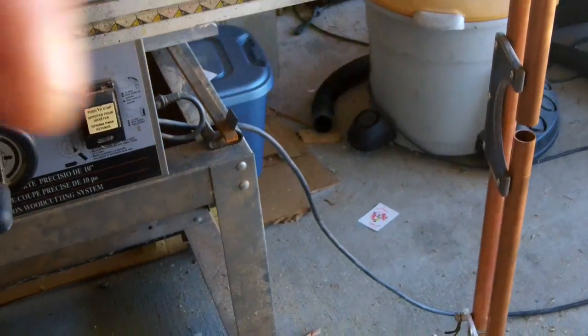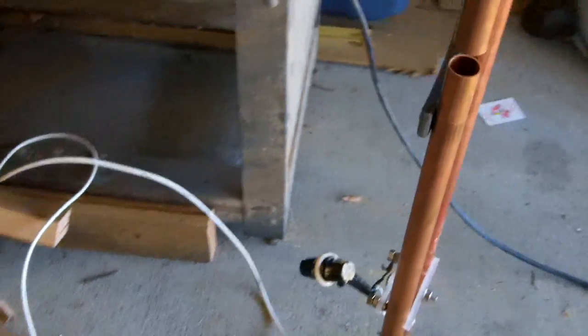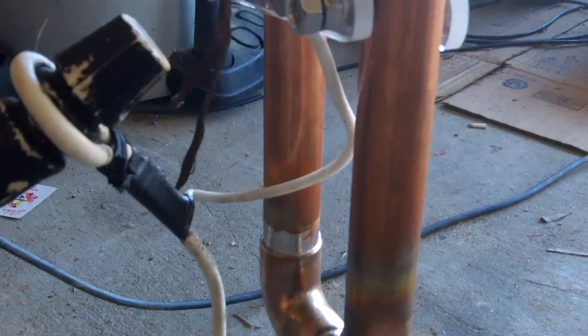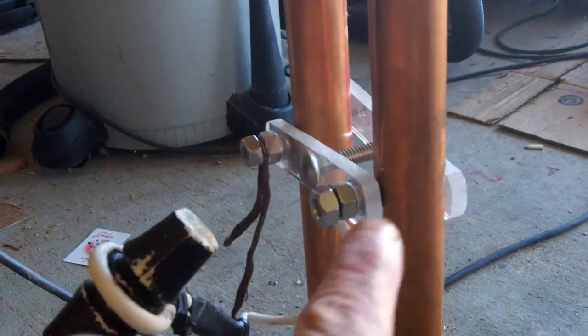All right, here we are at the abode of the Nick and Ben channel — y'all need to go check it out. Nick's at school getting smarter than us. We're going to go ahead and tune this antenna and find out where it resonates. We're going to be using a little Baofeng radio and a meter. Here's the tuning apparatus, we just got it hooked up. The antenna has to stay away from everything else — it can't be touching the ground, it has to be electrically isolated. The feed point goes through, makes contact, and this whole thing is just held on by the center bolt. We're basically going to run it up and down until we find the sweet spot.